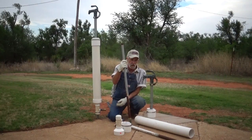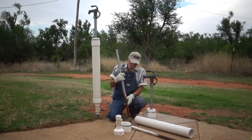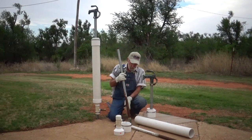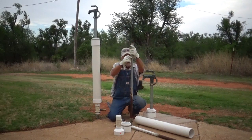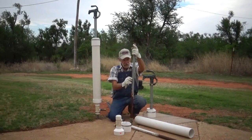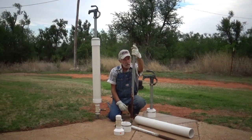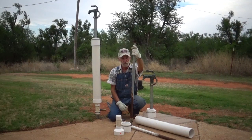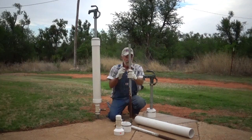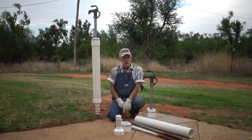Also, a reason for failure is depending on the corrosiveness and hardness of your water — the inside of your standpipe may get corroded. The stem connected to the plunger down here — a lot of these hydrants just have a carbon steel stem, and I've seen those rust out in as little as 18 months, depending on the mineral content of the water.